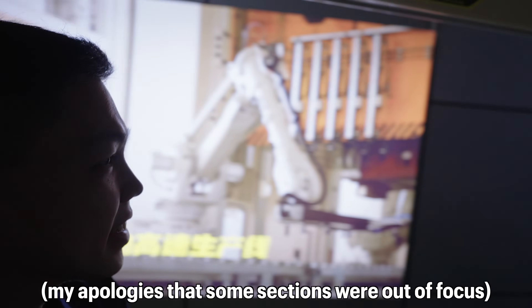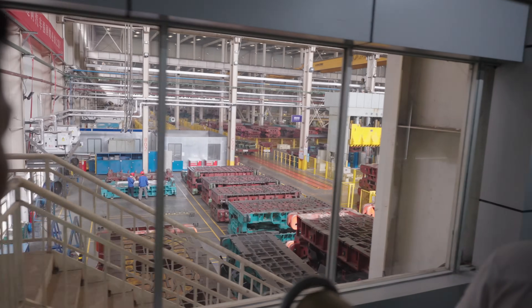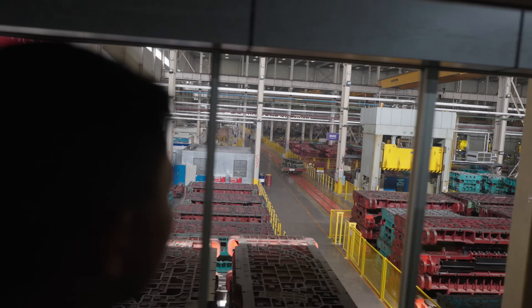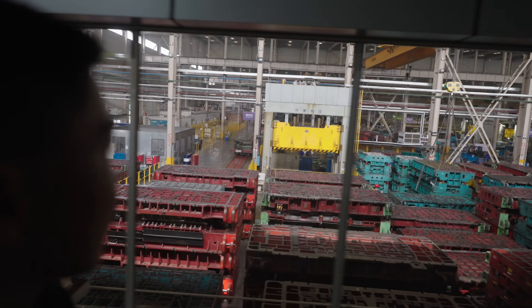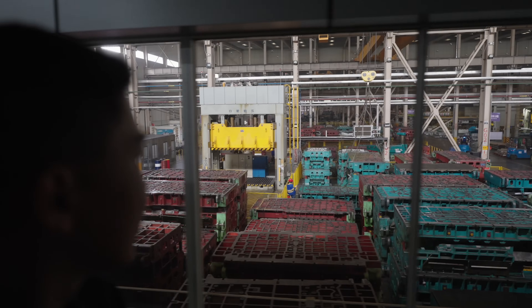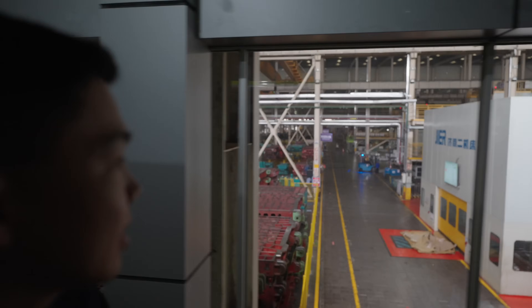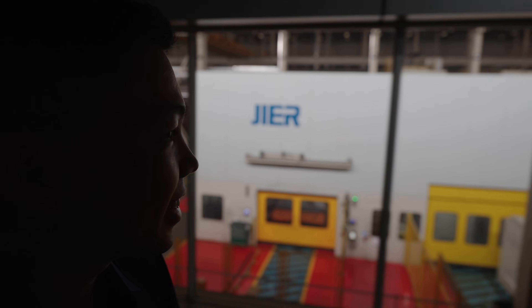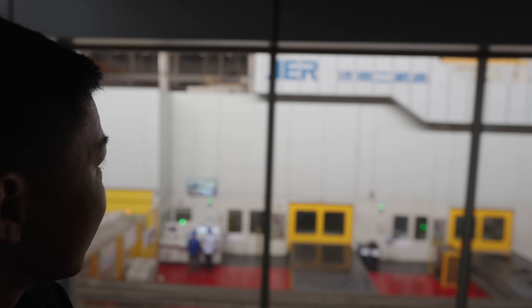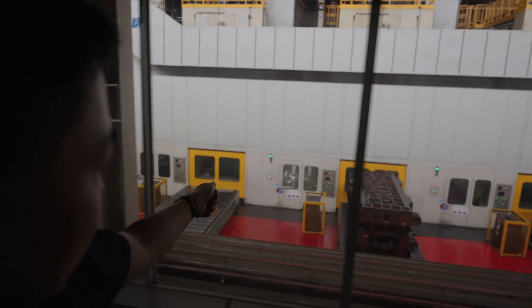You can see all the machinery here — that's the stamping area. The area of the Changsha stamping factory is 16,000 square meters. The stamping process is to separate and deform the purchased steel plates on a stamping machine, so it'll be a flat sheet going from one end and it comes off being cut to obtain the required exterior components of the car body. Changsha stamping phase one plant has 15 large and medium-sized press lines. You can see the stamping machines going through something with different pieces, and there are small pieces on the ground.